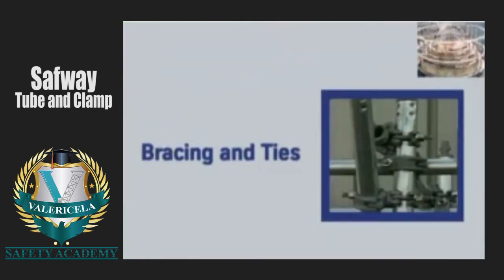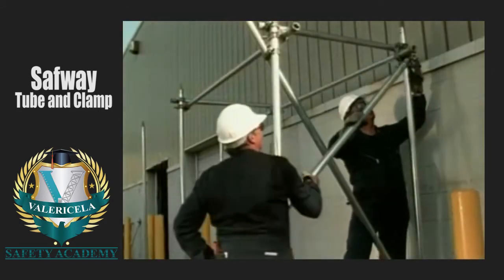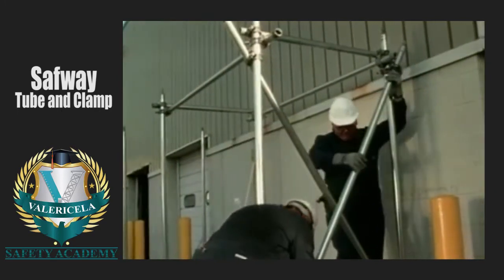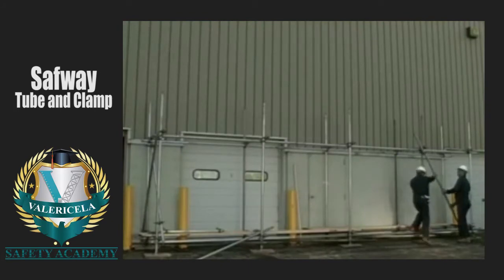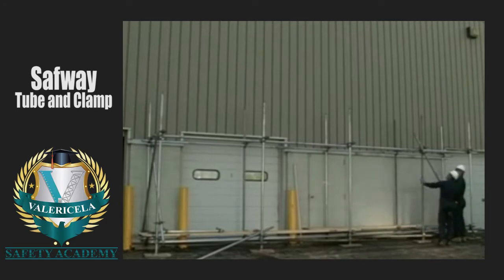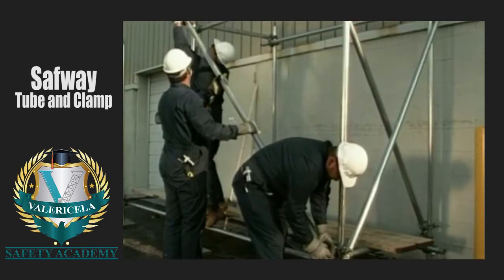The next element of Safway tube and clamp scaffold erection is the installation of bracing and ties. Braces and ties provide horizontal and vertical stability to the scaffold against sway and wind load forces. Braces and ties must be installed as the scaffold erection progresses. Begin by installing diagonal braces along the scaffold run. These are sometimes called sway or face braces. These braces are installed on the outside of the post so that they do not interfere with the decking. They must be installed on both faces of the scaffolding.